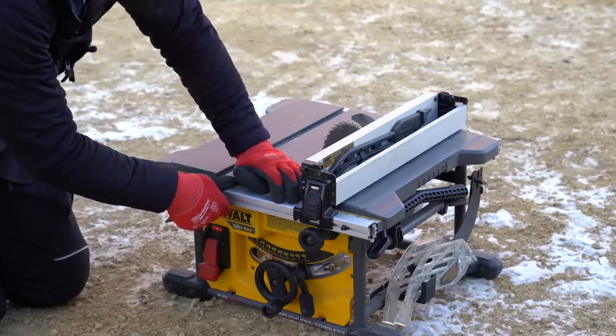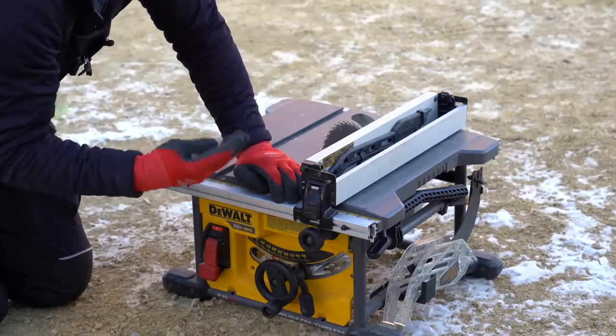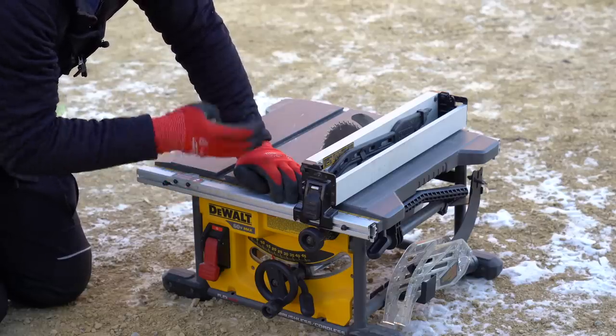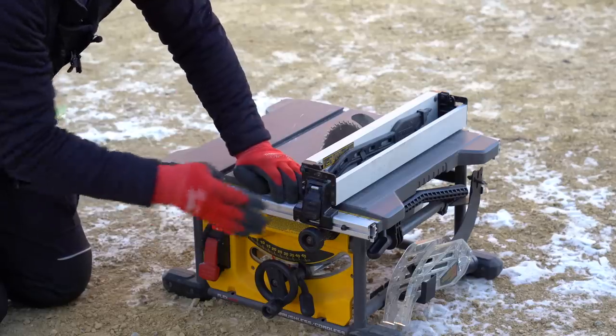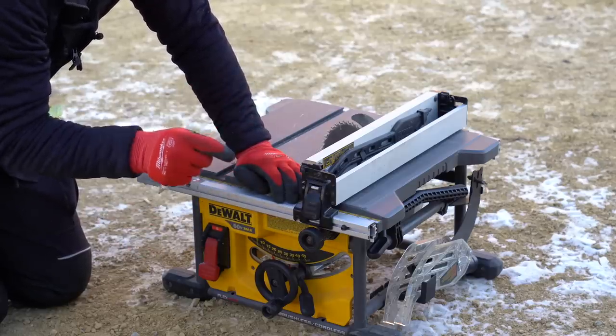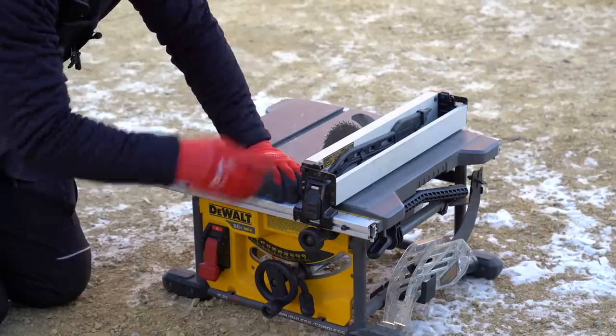Right now I'm gonna go ahead and cut my bevel boards, or what we call our in-betweeners. It's basically that last purlin row on the face of our columns, because there's really no way to run a purlin there. So we run our tails, and then we've got that two by that goes across that opening, so we have something to fasten our steel to between the overhang fascia and that first purlin that sits above our tail.